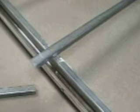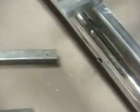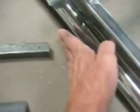So what I'm doing here is I'm cutting a new piece of steel that's going underneath this frame and raising my wheel height up. I'm not going to use these holes in my chrome tubes anymore as a carrier for the axle. The axle will be welded onto this piece of steel, which is going underneath, in between here, and it's going to stick out past the chrome tubes about that far.